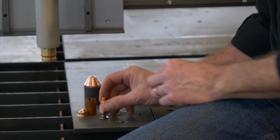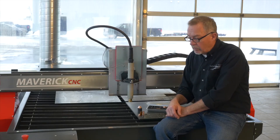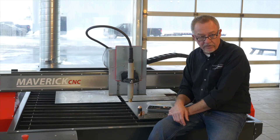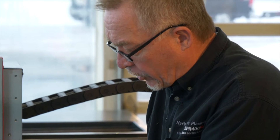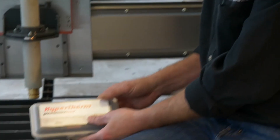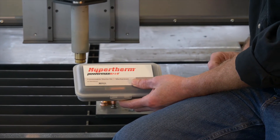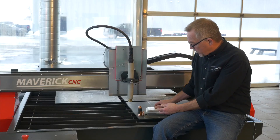So these parts are all critical inside the plasma torch. There's a lot of information about them in the manual, and there's also a lot of information when you talk to the tech service departments and the customer service people at Hypertherm and the manufacturer of these CNC cutting tables. One more thing I do want to mention: the starter kit that comes with your plasma system has maybe one or two of the basic components used in the torch. Once you've gotten familiar with it, there are a variety of other kits focused on the material thickness that you're cutting — you can buy a kit that's just made for thick material or just made for thin material — to get the biggest bang for your buck with these consumable parts. Thank you very much.